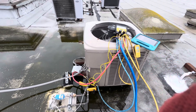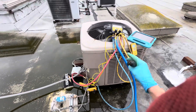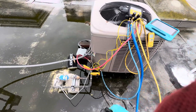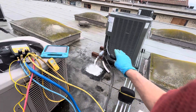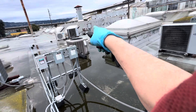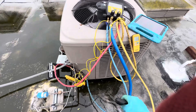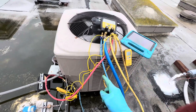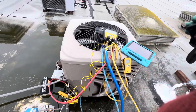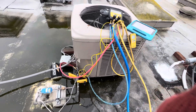Premium units are already rated to go down to negative 14 degrees below zero. You don't have to add anything. But with these cheaper units you're always adding third-party aftermarket components. If you want voltage suppression and that kind of stuff, all of that is unnecessary if you would have bought a good piece of equipment in the first place. You've got three-phase surge suppression in each unit, but you could also put three-phase surge suppression down at your main box — not your sub-panel, but your main box — to protect all your units from voltage spikes instead of doing each one individually.